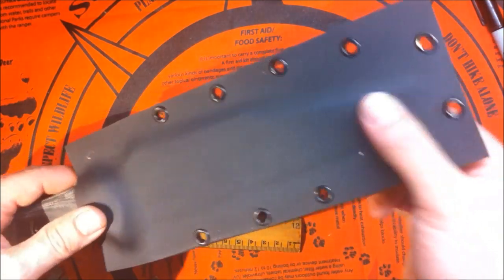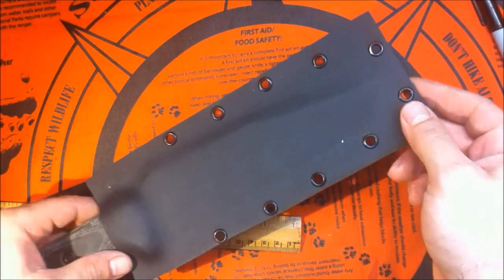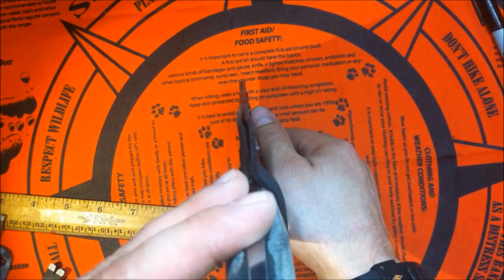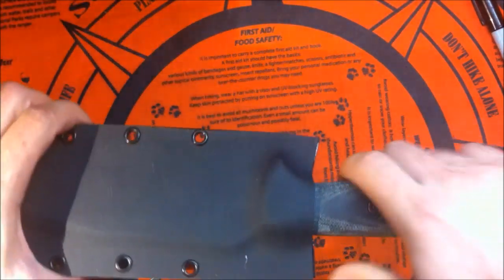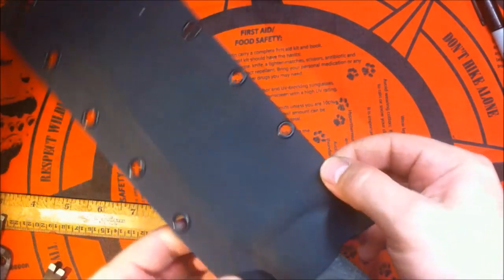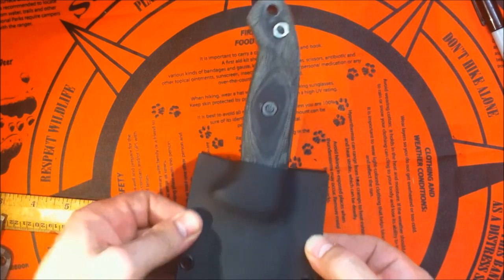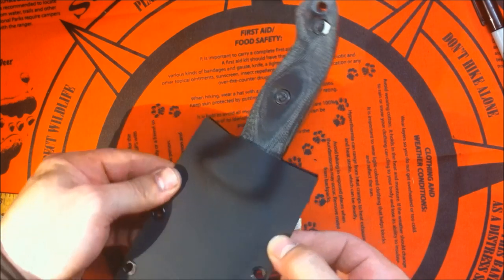Like I said, I had to do it two times, first mold the back portion of the sheet and then the front, but as you can see, you have a nice outline of the blade on both sides, nice and equal, pretty much straight. Now, I have really weak retention, and I don't like that. I still didn't do the last rivets. I tested with the clamps, just putting them here and moving them to see where I want to put my last rivets to get the desired retention.